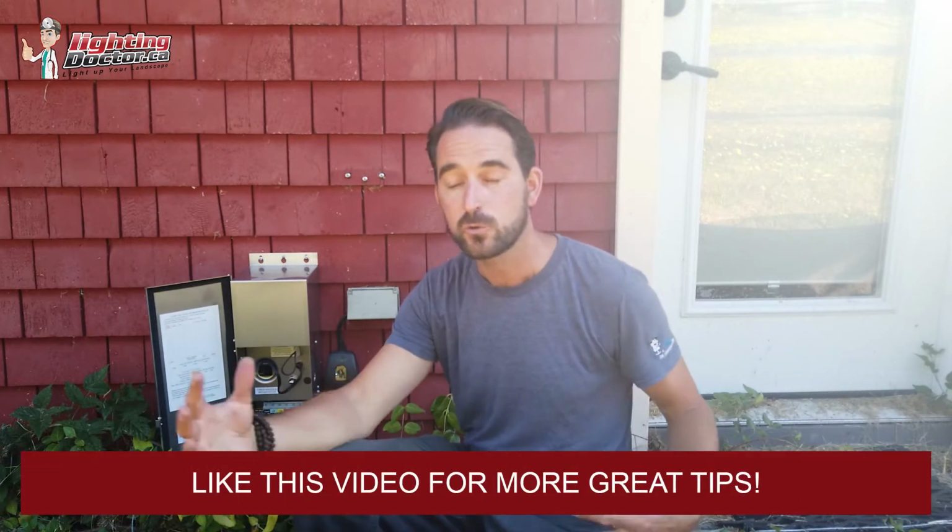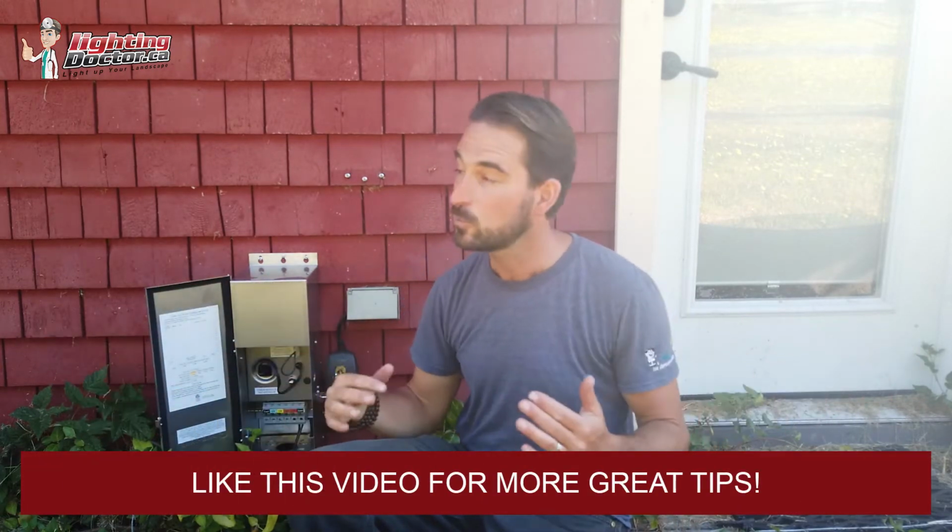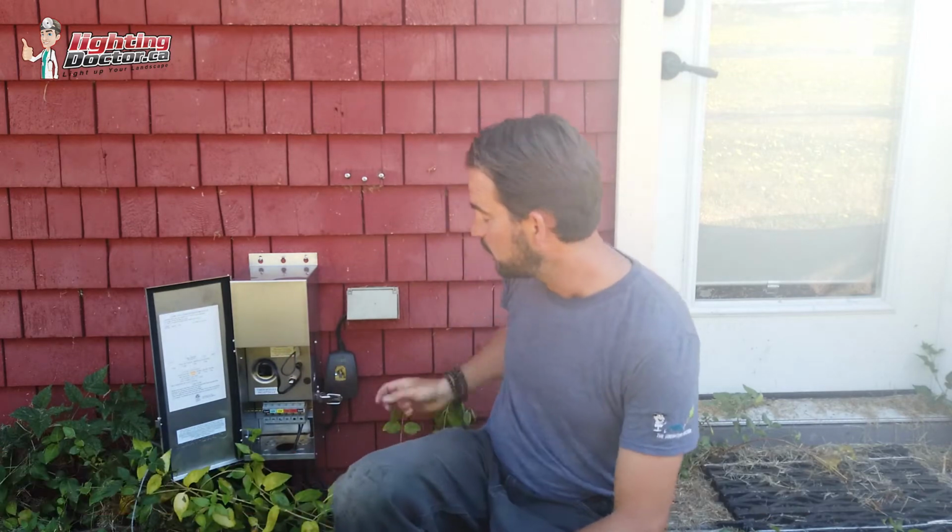There are transformers out there where you can have one transformer that runs, say, a zone for your front and a zone for your back. In all honesty, they're pretty confusing to work, and they get quite expensive, and there's some limitations and all that kind of stuff. So I'm going to tell you a real cost-effective way of doing that, especially if you only have, say, a front yard and a backyard zone. If it doesn't matter, then just run them all off the same transformer. But if you want to control them separately, front yard, backyard, with simple on-off functions, the best way to do it is just with a simple Wi-Fi timer like this.